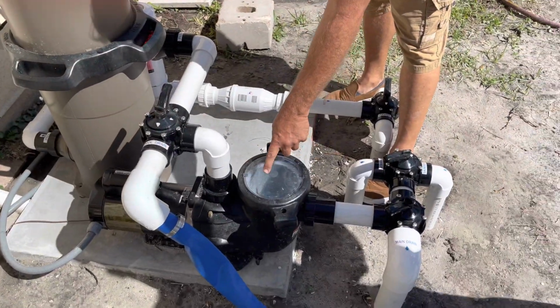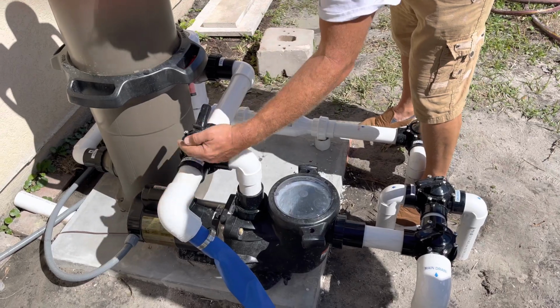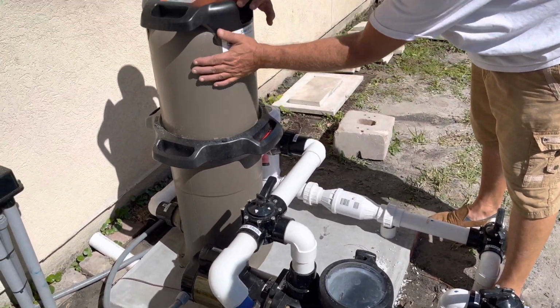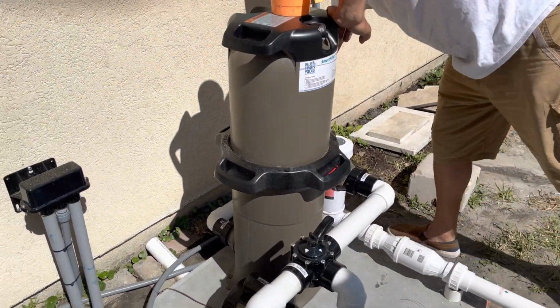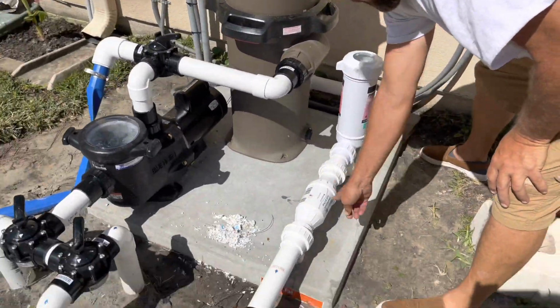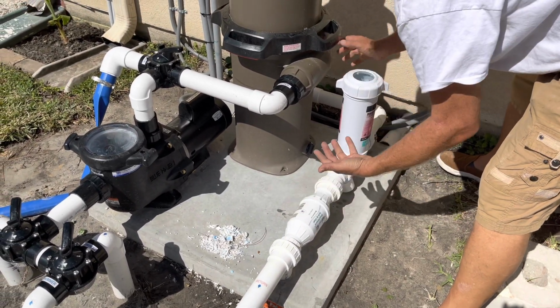But things that can get through little holes comes up through here. This 3-way valve is closed. We're not draining any water. We've closed it, so we're forcing water here. Now water's going into our filter. We're going to go over that in a minute. Water's coming out of our filter. The bottom, it comes through here. It goes through here at 150 gallons a minute. We're going to go over both of these in great detail, but for now we're just going over the run.